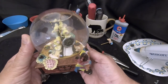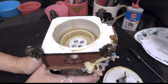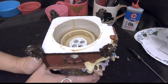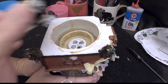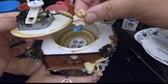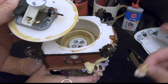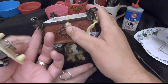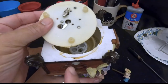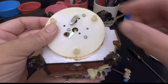The glue has cooled, holding and sealing the stopper to the globe. We did a test fit to make sure the mechanism still works, and it works fine. This also has a side ornament — a mouse that comes out of the side of the base and twirls, attached to the music barrel. We need to line this up so the hole and shaft are aligned, so we marked two dots — one on the base and one on the cover where they line up.